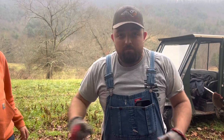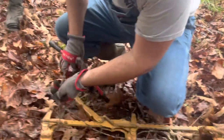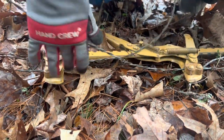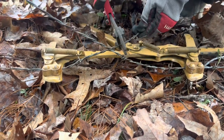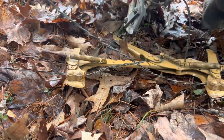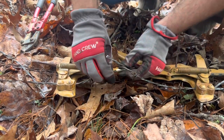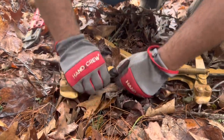That's about good — you only need to go about as much as you can wrench it down, you don't need to keep going a whole lot. Then I'm going to cut this one off right about here, and this other one off right about here. You want a little bit of overlap, then take your splice and run it down and get both pieces of barbed wire in there.